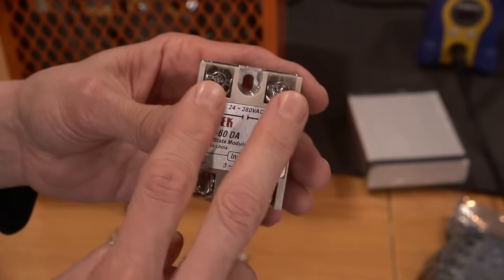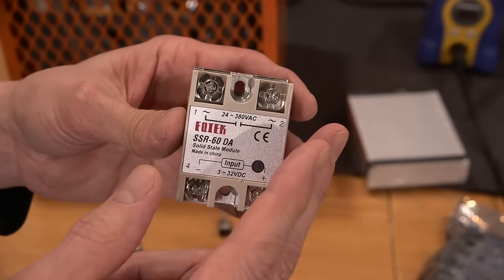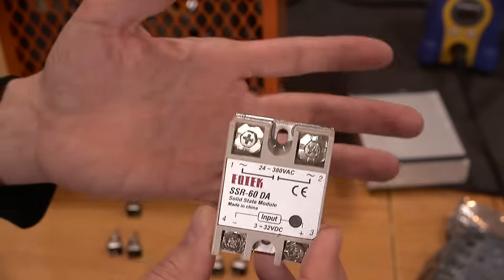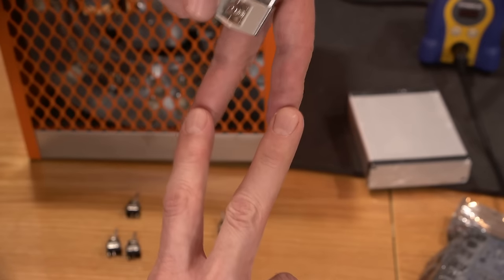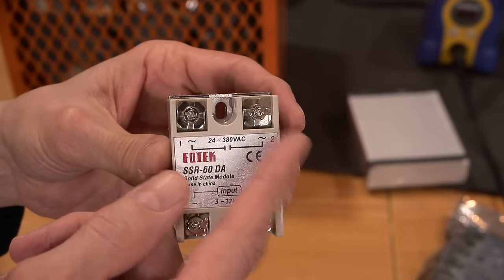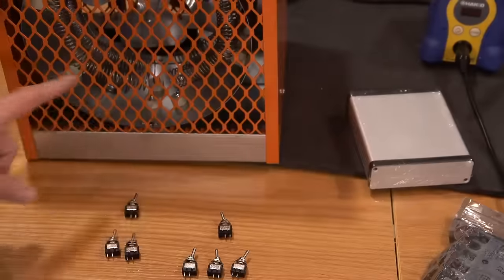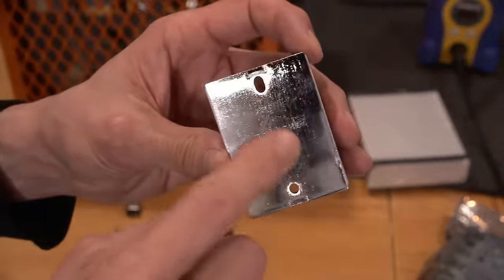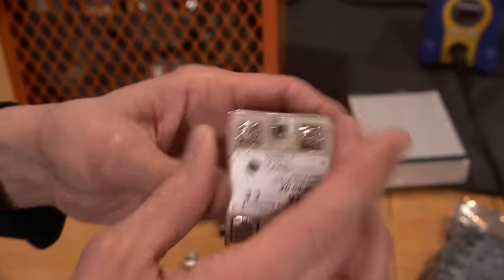And there's always drop across triacs, right? So whenever you have drop across a device, we have dissipation, right? It's going to get hot. So it's not like a normal contactor, like a relay contactor, where you have contacts that go click and they close and there's very low resistance. Anytime you have drop across a device, you can look at that like resistance. And of course, resistance is like what this heater is doing, right? It creates heat. So that's the reason that they have the little device in here bolted to this piece of metal. It's obviously supposed to be heat sunk to something.